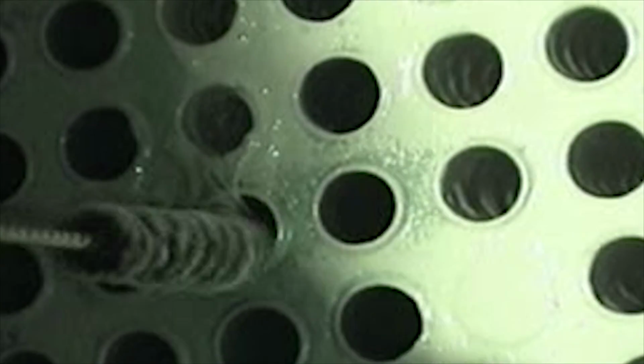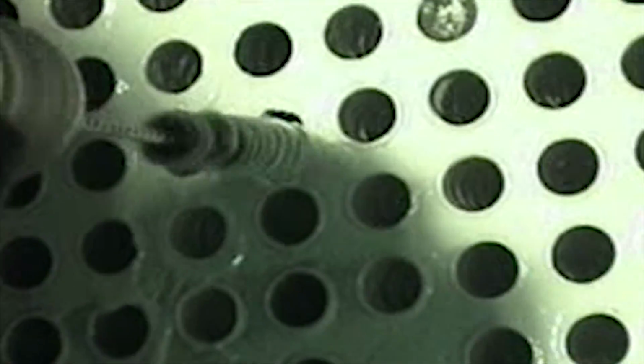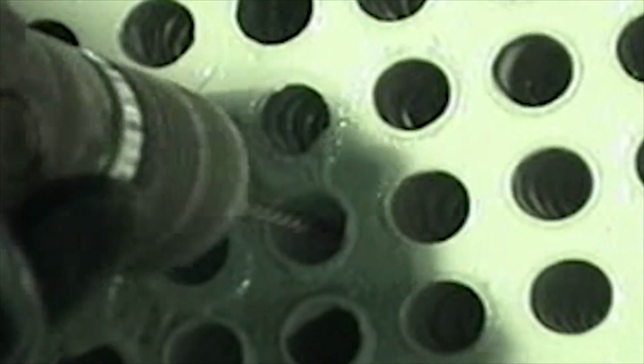In this instance, we're coating about 4 inches down each tube, which is about an inch past where we're seeing the severe inlet corrosion. Again, work the material in to get the best adhesion and to prevent the material from puddling. We're using EE11, which is a high abrasion resistant material, also very flexible.